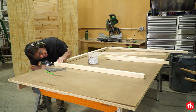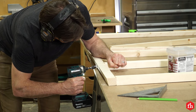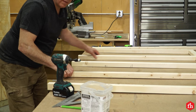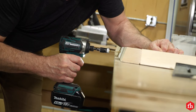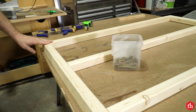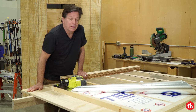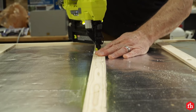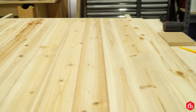After measuring the length and width of the top opening of the sauna, move on to building the roof frame out of 2x2s. The top and back boards of the frame both get 15 degree angles. Then attach 2x2 studs equally spaced. Now that I have my frame built, I've attached it to my roof deck, which I cut out of three quarter inch plywood. I've insulated the stud space with foam insulation, added a vapor barrier, and of course we need our quarter inch strips for the vapor gap. Then cover the whole ceiling with cedar shiplap.